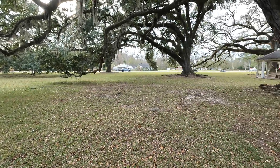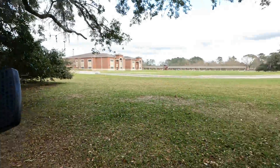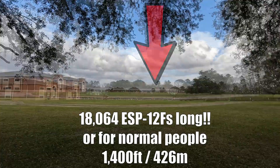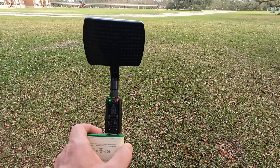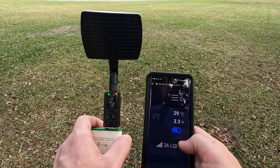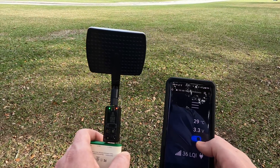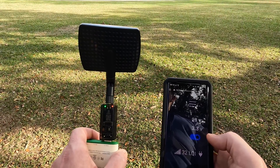We're all the way over where a lot of people take pictures, and let's see if we can do some Zigbee from way over there, probably behind those trees. I have an antenna set up - a battery-powered Zigbee stick with a directional antenna. The red light we can control via Zigbee2MQTT. This is using VPN to the house because my Wi-Fi doesn't reach here. We get 36, absolutely insane - 40 LQI, and it just works.